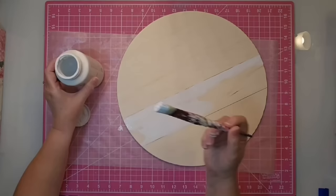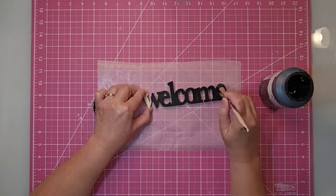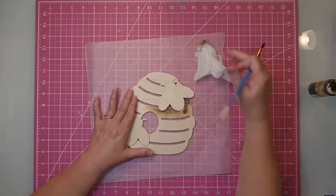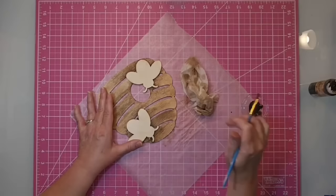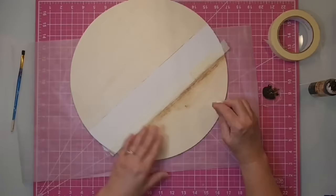I always paint the edges too that match up with the front. I'm going to paint this word 'Welcome' with the Waverly chalk paint in the color ink — I painted the front and all of those little nooks and crannies and edges. I used a combination of a baby wipe and a small paint brush to get into all those nooks and crannies on this bee skep. I'm using antiquing wax to stain only the beehive part, making sure it's not exactly the same color all over, wiping off areas that get too dark and leaving some areas really light. I'll also stain the top four-inch part of the wood round with the same antiquing wax.